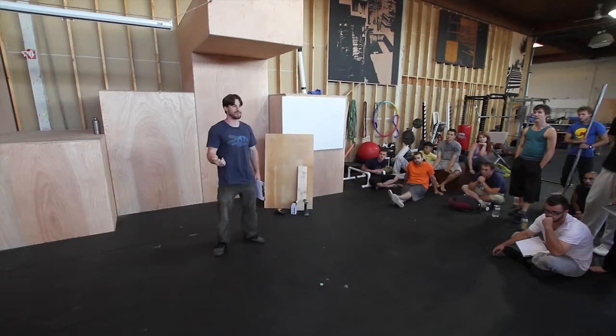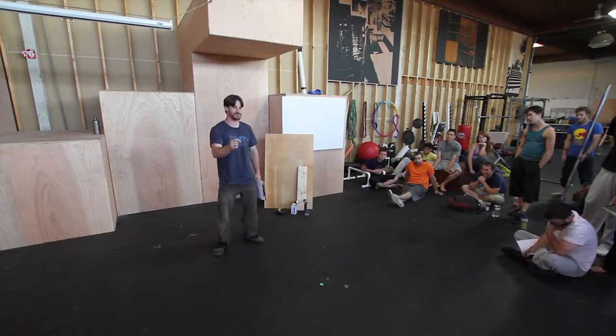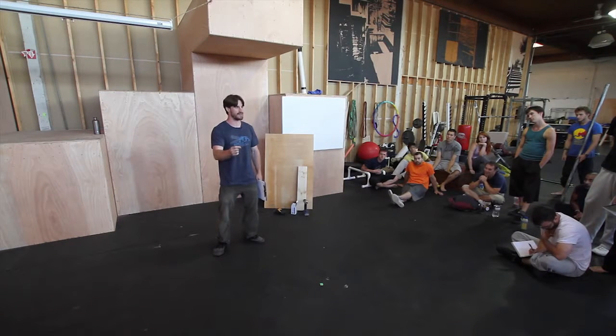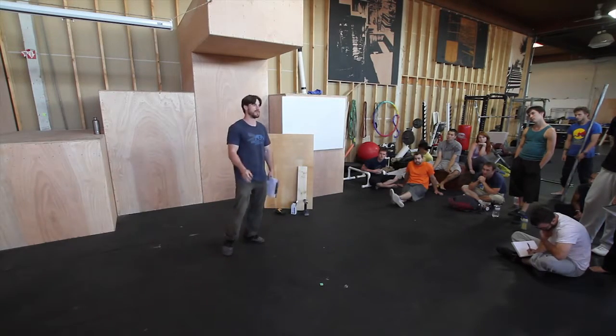So yeah, you can glue the threads of the fastener in. Loctite is something that you can put on bolts. You can put it on all sorts of different stuff. You can actually just dip screws in epoxy and screw them in, and they will become very, very strong because epoxy is a ridiculously strong glue. And if you don't have access to bolt something, usually that is probably going to be your strongest way to attach something.